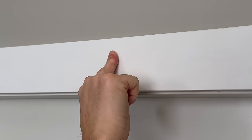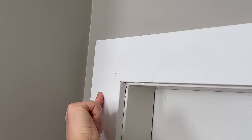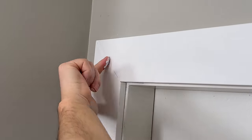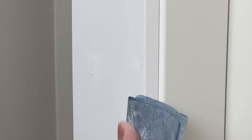You don't want to make a huge mess, but you want a little mound so you can come back and sand that off. Hit all the nail holes, and then for the miter seams, take some more on your finger and just rub it into the crack — rub it in so you've covered that crack and mound it up just slightly along the seam. When it comes to sanding, avoid sponge sand. I like to use a nice sheet sandpaper — 150 grit. It's aggressive enough that it's not going to take forever.